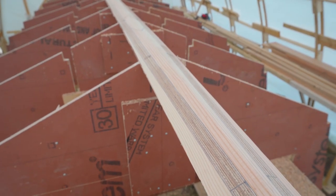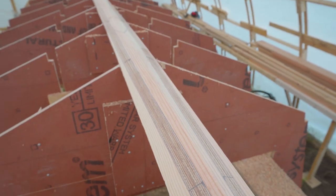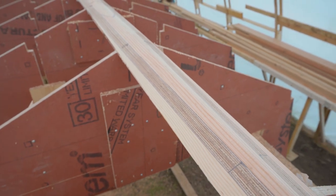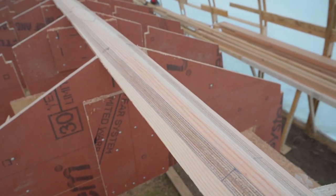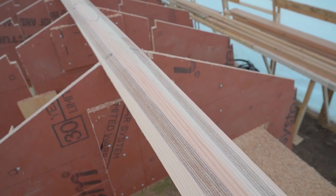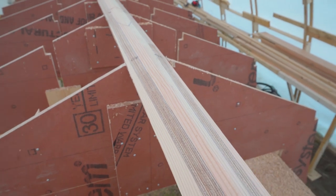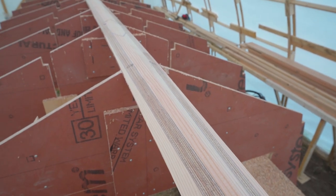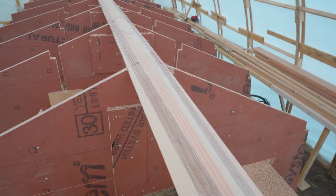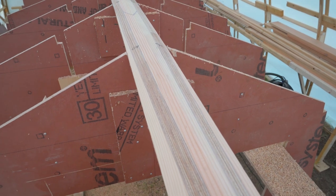Now, the main way to tell that that's not happening is by looking at the laminations of the plywood and then the inner and outer pieces of Douglas fir. And as you can see, it's symmetrical, and the curve that's formed by this little plywood layer right here is fair. If I had left a hump in between the station molds, what you would see is a little zigzag in this plywood layer, and that's something that I'm not seeing as I sight up and down the length of the keel.